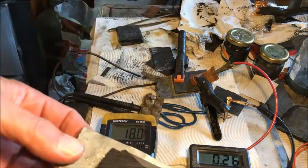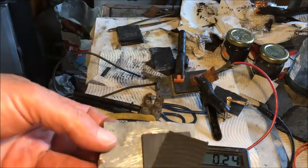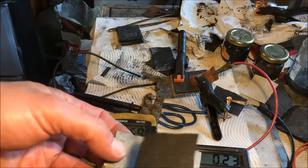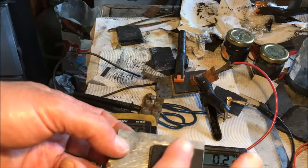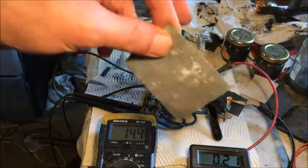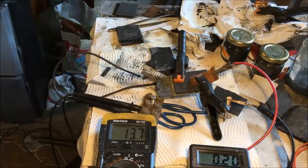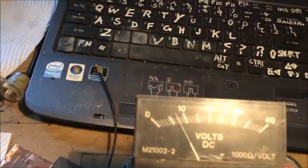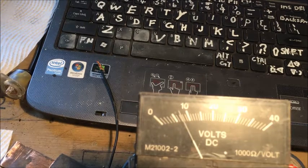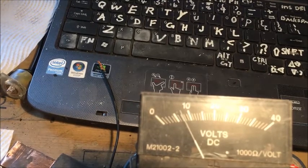Today's test cell is going to use the membranes on the zinc plate. I have an electrode with Manganese Dioxide and a layer of Feather Carbon, and the various membranes will go directly on the zinc side. We'll charge this up for a little bit. When I connect it, it drops down a fair bit and increases the amps going to the cell. I'll swap that over to the 10 milliamp range and do a one minute charge.